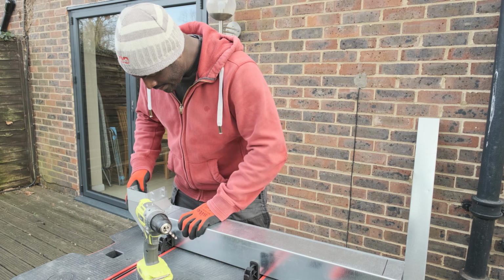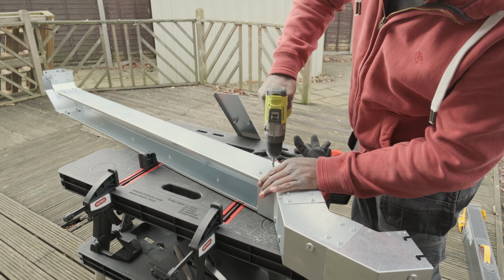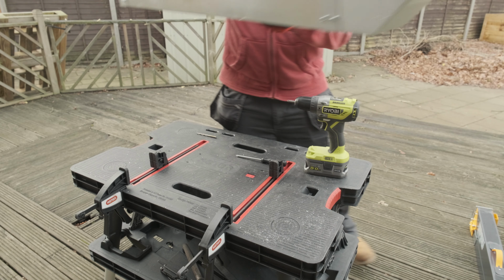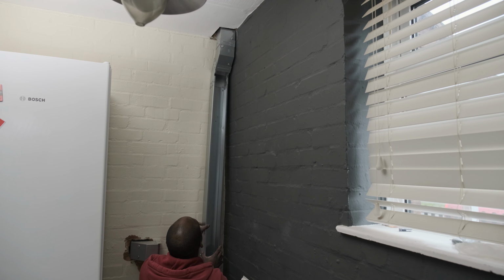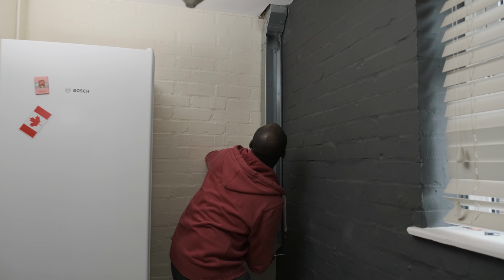The plan is to assemble the 90-degree bends and the offsets as one piece, though because I cut the ceiling close, I'll have to take out the last 45-degree bend and install it from above. Since I only have one pair of hands, I'm temporarily fixing the 90 in place so I can drill the holes for fixing the straight section.